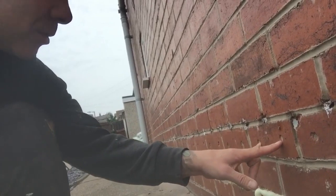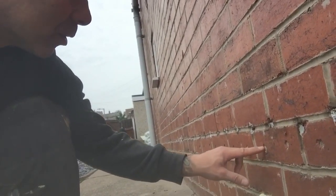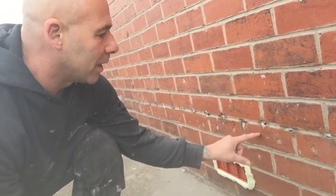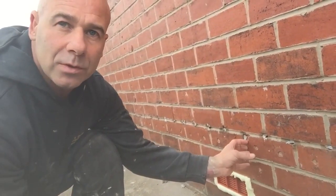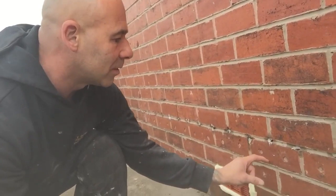They used to drill and inject into these two holes using a high pressure method. A lot of the time it was silicone, then they changed it to a water-based one. When I first started back in the eighties, this is how damp proofing got taught. We used to tell all labourers that when you had your rods in, you'd see a wet patch start to emerge round each circle as it were filling the pores in the brickwork. What they used to say is when these two circles made a figure of eight, then you had to stop - which was a great load of rubbish.